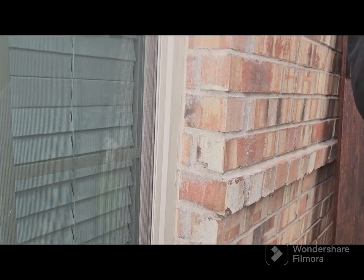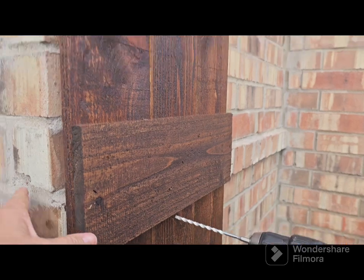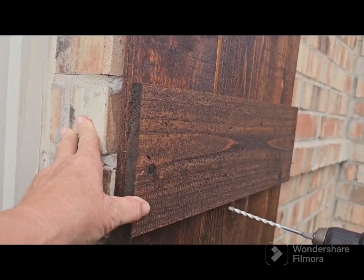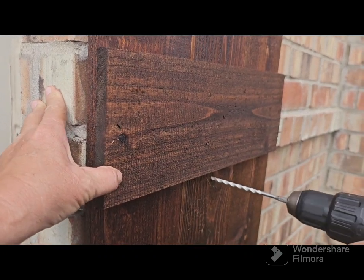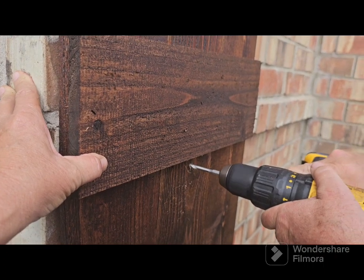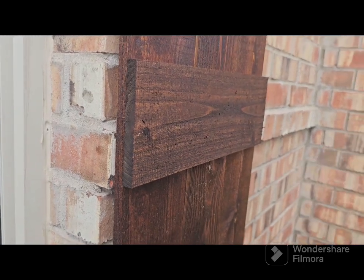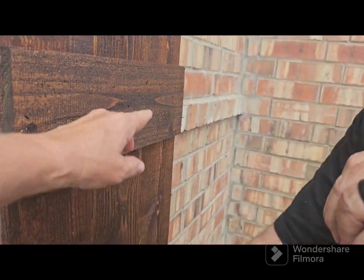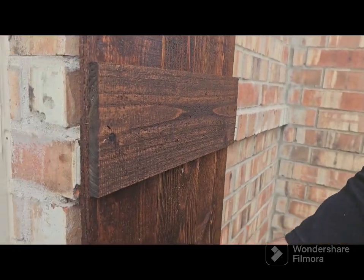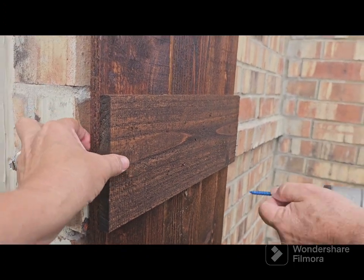I need to hold the shutter up there. So just see how that all lays flat — it's not slanting. You always want to put the screw underneath the board to hide it a little bit instead of up here where they can see it, because concrete screws come in blue and stain doesn't hold up to these screws, so you want to try to camouflage them.